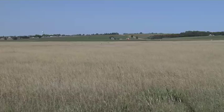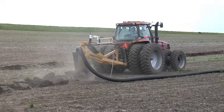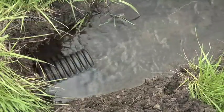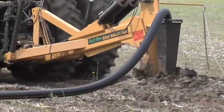In South Dakota and North Dakota where there are potholes and some wetlands, people get concerned that they can't tile anything. But you can tile a lot of things — yes, you can't tile a wetland, but you can tile around areas that have wetlands and tile any fields certified as non-wetlands. I've also had people say you won't get all your neighbors to go along, but in our tiling project if I have a problem they have a problem too — my water is seeping below ground into their field, making it wet. If we get all that water moving through properly, everything works out.